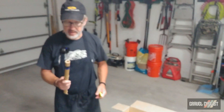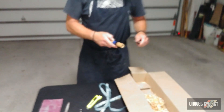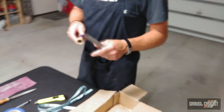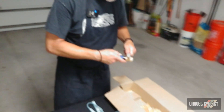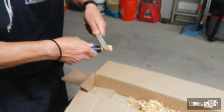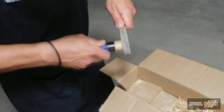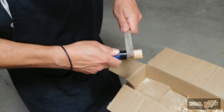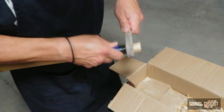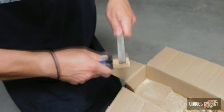This is how much material I generated from all the tubes for this frame project — your mileage may vary since some tubes fit snugger than others depending on your kit. The next step after getting it reasonably close is to take a rough file or a rasp and smooth it out even more. I'm using my grandfather's tool — a hundred-year-old rasp — just to work down those fluted areas from the whittling a bit more smoothly.